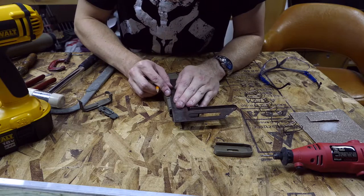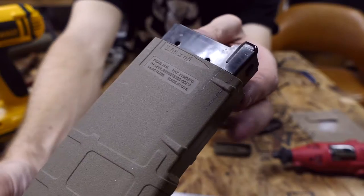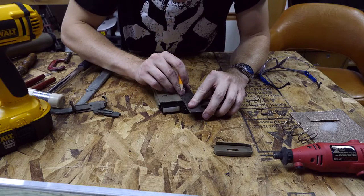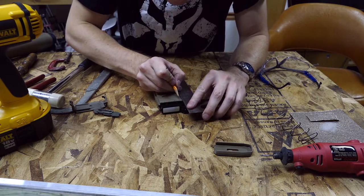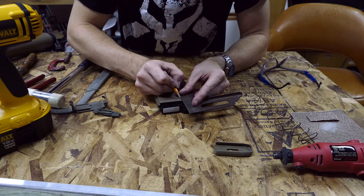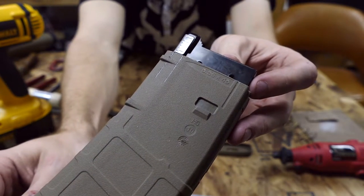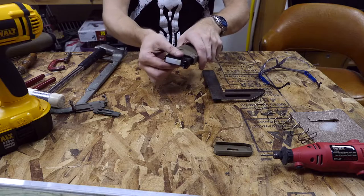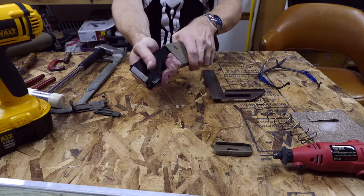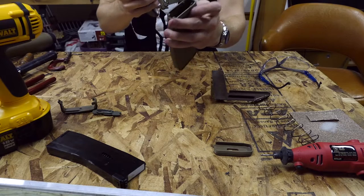You can see that's basically what we're doing here in the video and it's a really simple process. We've basically got our marks lined up with the dust cover. Flip the magazine over and make those exact same marks using a straight edge or ruler on the other side. Again, here you can see the marks in place lined up with the dust cover. Now take your internal out of the external PMAG, set the internals aside, and you're basically ready to start making some cuts for those dust cover cutouts.